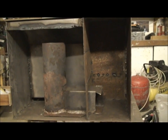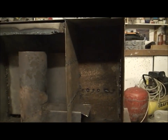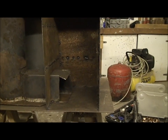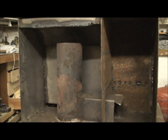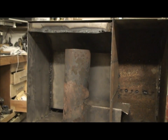I've got most of this welded up. I've used one of the old experimental riser tubes. You can see the gap underneath the boiler. The firebox opening is way too big as it stands — I find generally the opening should be around the same size as the entrance to the riser tube. Also, the boiler is a complete and utter disaster — there's more holes in it than a colander.